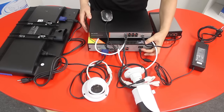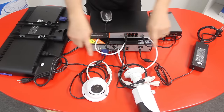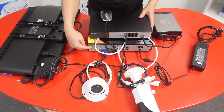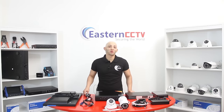That's it! The last thing you need to do is turn on the switch, and that's how you set up and connect your NVR unit using the external PoE switch. You can repeat the same steps for as many cameras as you have — connect the first four into the built-in PoE ports on the NVR, then the rest onto the external PoE switch. If you liked this video, don't forget to click the like button, share, and subscribe for more upcoming videos. For more information, visit our website at EasternCCTV.com. Thank you for watching.